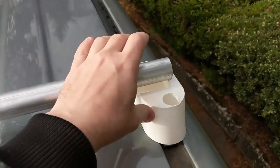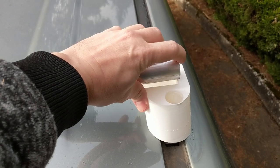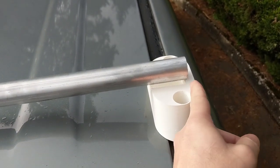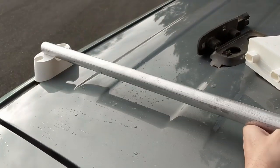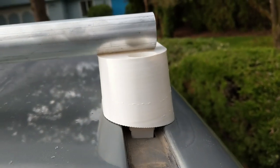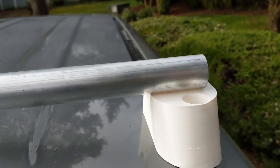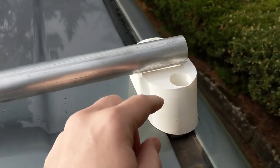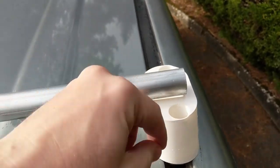On this side I'm off by an eighth of an inch on my calculations — that's exactly a 48-inch piece of aluminum, so I'll have to adjust that. But if I lift this up out of the thing and just put it across the tops, we see no daylight underneath, meaning that angle is perfect on this side. I'll just mirror image this part and it'll be perfect on both sides.